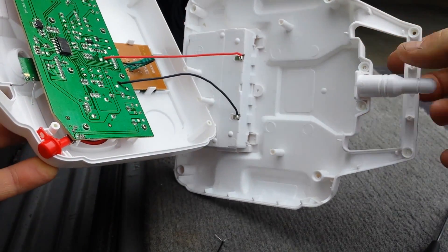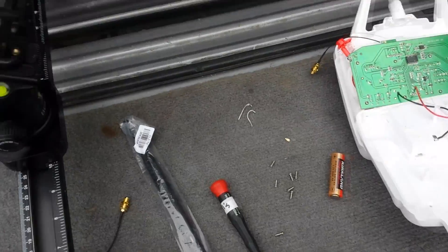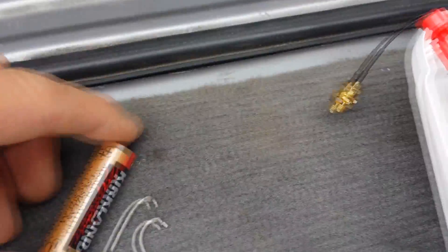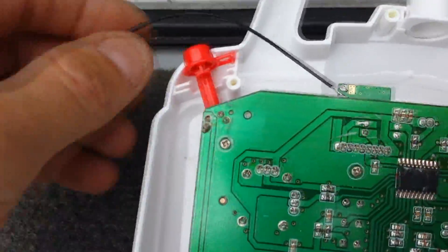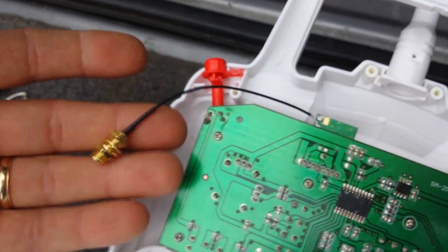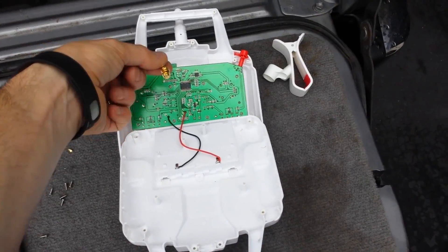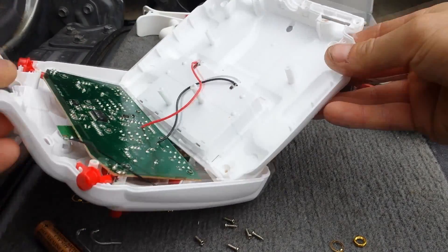I'm eliminating these short little wires and soldering to that point and that point. I'm going to drill a hole in the back of the housing and make this stick out so I can screw on the antenna. There's my original antenna which I removed - about an inch long, two little wires, that was it. There's my aftermarket socket and that's where I just soldered it to those two points where the antennas came off.